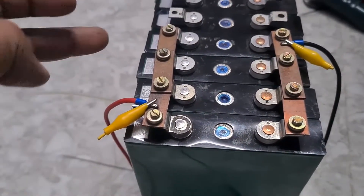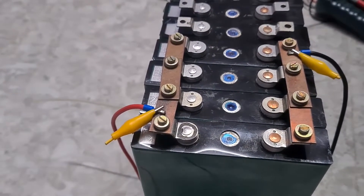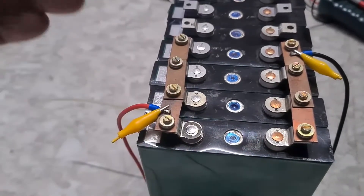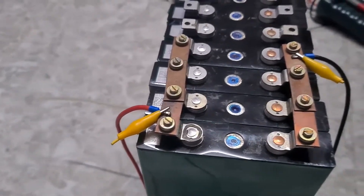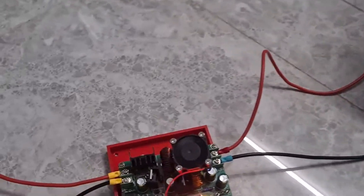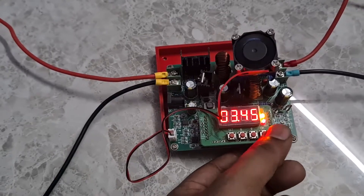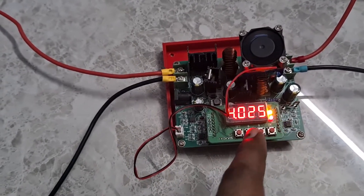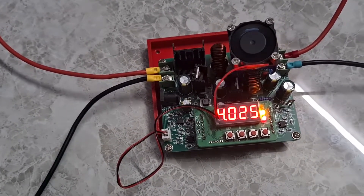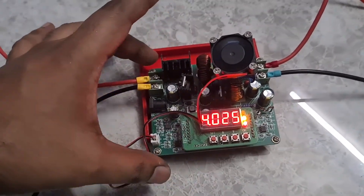I have connected four lithium iron phosphate batteries in parallel for now because I ran out of busbars. I'm going to top balance these four to 3.65 volts and then move to the next set. Being at 6 amps, I think it'll take maybe five to six hours to at least reach the tapering voltage of 3.60 volts. This is how you top balance cells.